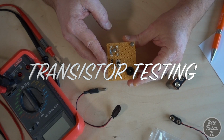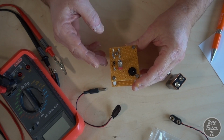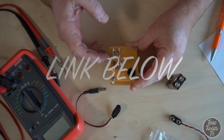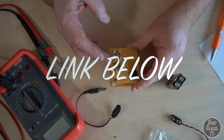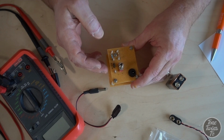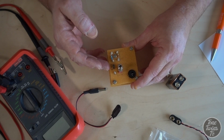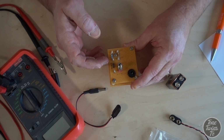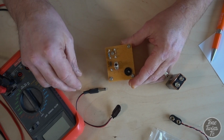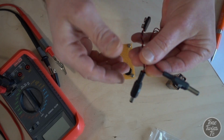Well, you may be wondering what this Heath Robinson contraption is. It's actually a transistor tester. I used the circuit provided on R.G. Keen's Technology of the Fuzz Face. Although it's designed specifically for testing PNP transistors, and we're using NPN transistors in this particular fuzzbox project, you can use this device to test both types. All you need to do is reverse the polarity of the power supply.